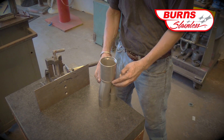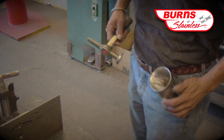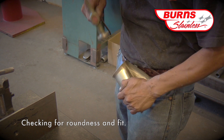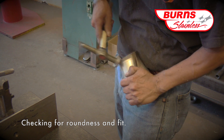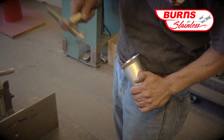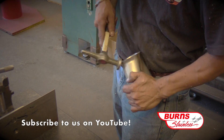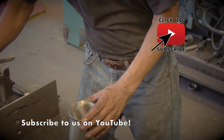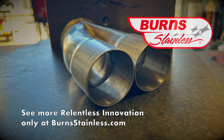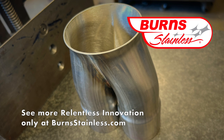Now it's time to fine-tune the collector. Fernando has taken a piece of 3-inch tubing and is looking at the outlet of the collector, making sure that it's a nice, even fit. If the collector is out of round — which it always will be — Fernando takes a hammer and gently taps the collector in at the places in order to make it round and to make it the right size. At the end of 11 and a half minutes, you have a beautiful collector with a nice polished interior, the exit checked for roundness, and the inlet slips checked for proper fitment.